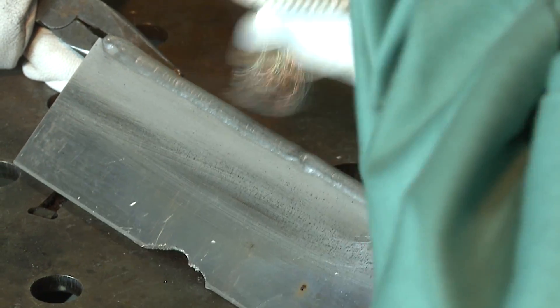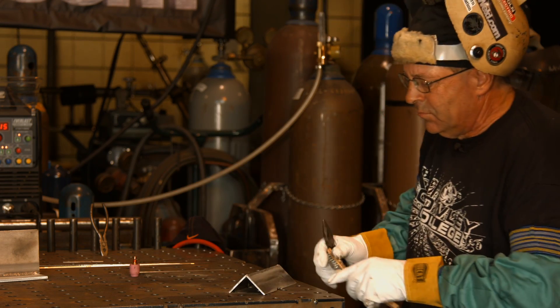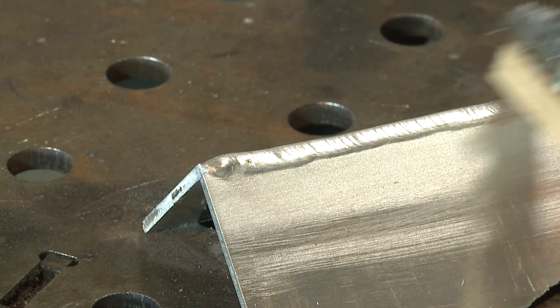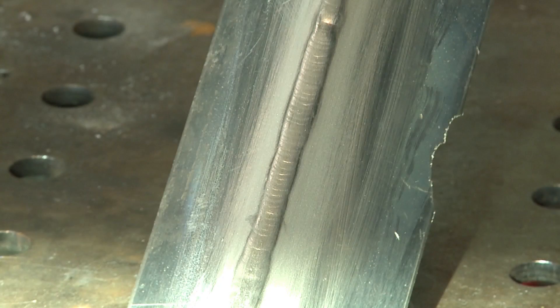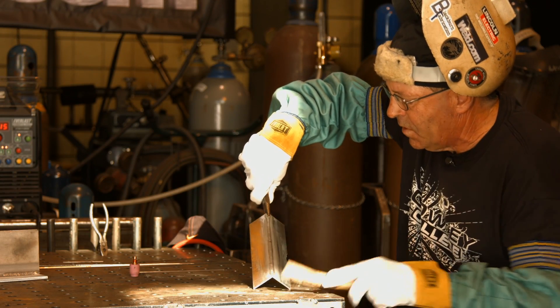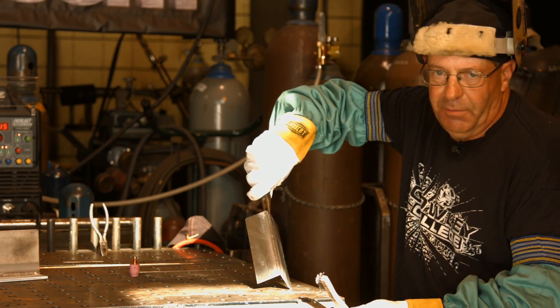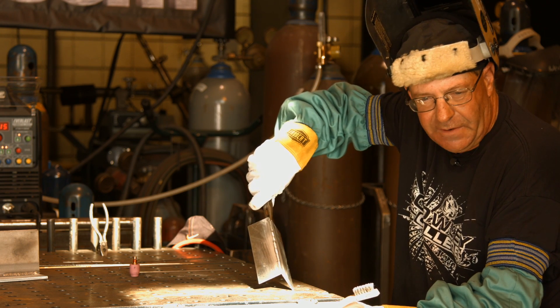I said I was going to hit this hard at the beginning and I think I hit it too hard. I did get some really good stuff right down through the middle — I did back off the heat and restart. We're doing eighth-inch, half the thickness of that fillet, plus we're on the outside corner joint — first time for me.